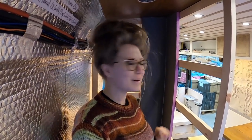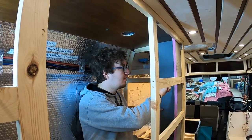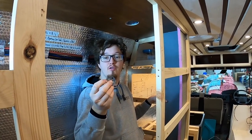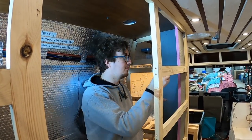We were a little worried about the right-angledness of our build, but we're really happy - the right angle has gone in nicely. We're going to attach it by screwing through the waterproof panel into the timber frame using wood screws, along with one of these special washers that comes with the product, just to stop you driving the screw all the way through.